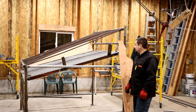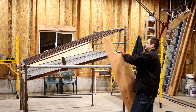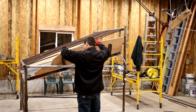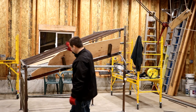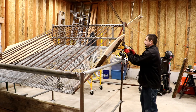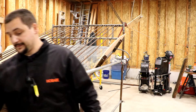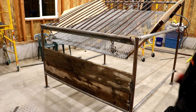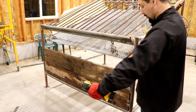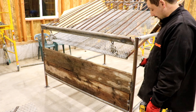That was the first kind of — I'll call it a chute guard. It's to keep the dirt in the shaker table, so it should catch it here also. Minus a couple of bolts, this is in place. These are so the rocks will come down here and follow it on this side, and as that pile builds up, when you come in with a tractor you'll have something to push against so that you're not pushing the rocks into the clean dirt area. At least that's the idea.